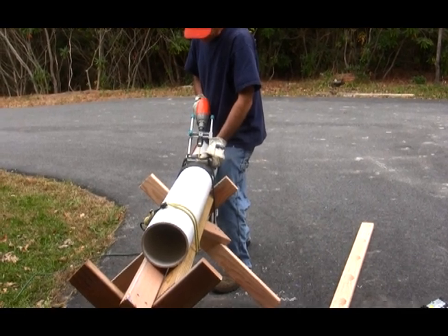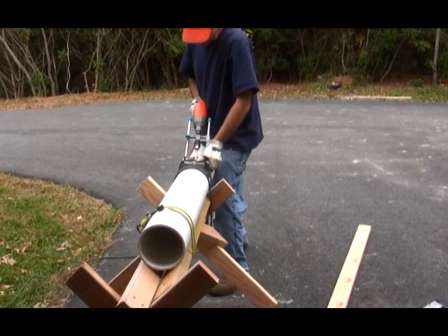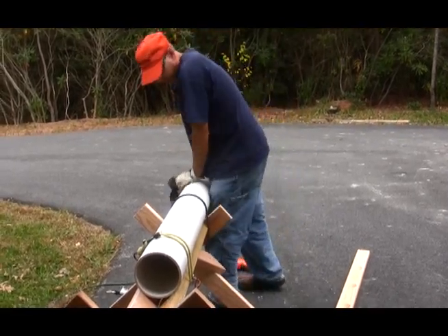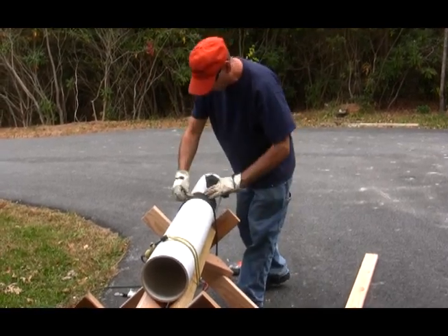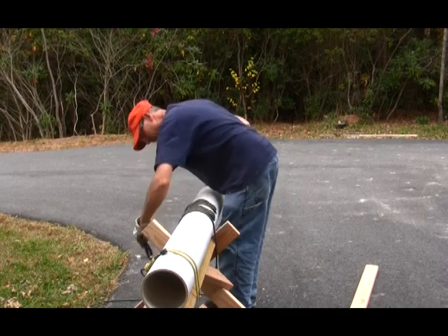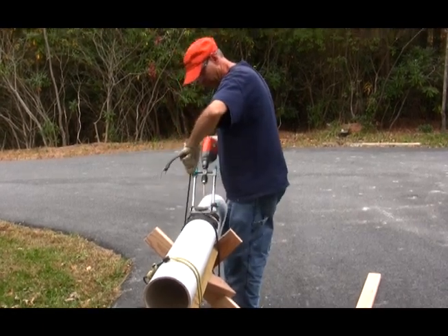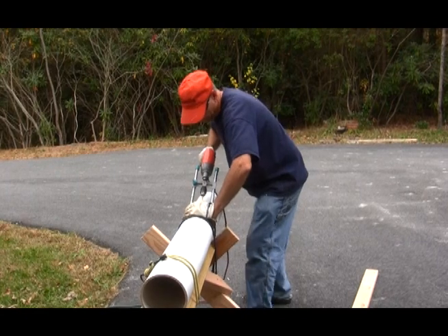The first part of the procedure is to drill half inch holes at a 45 degree angle in a 6 inch sewer drain PVC pipe. I use an old inner tube and some squares cut out of it to help hold the drill guide in place, as well as a rubber bungee cord so it does not slip around on the PVC. This holds it in place well enough so that I am able to get my holes started.